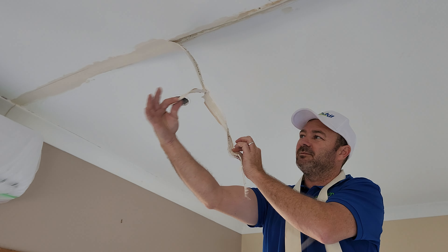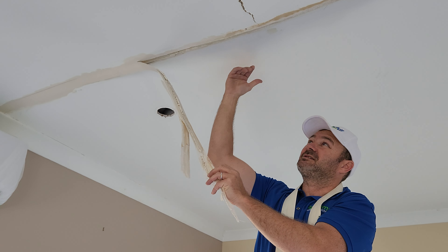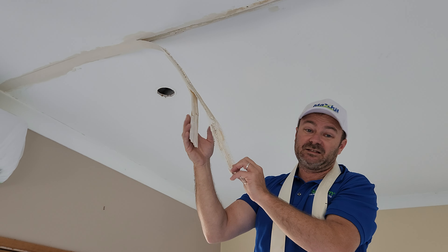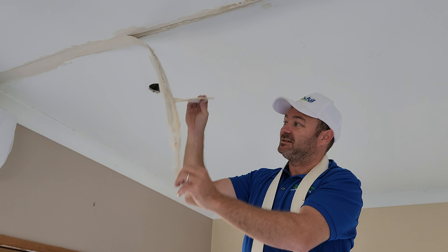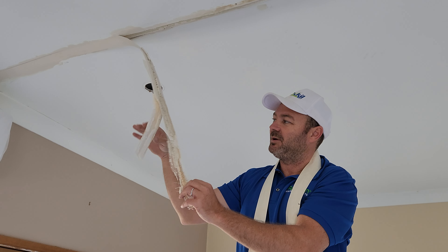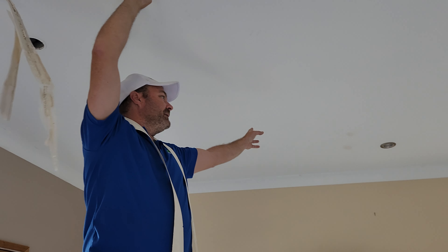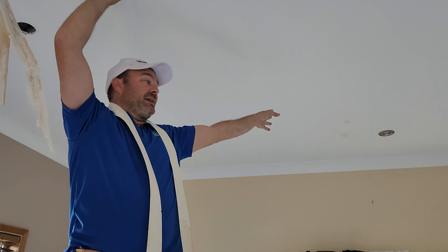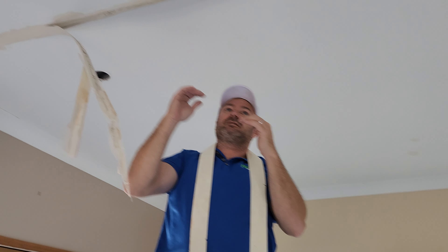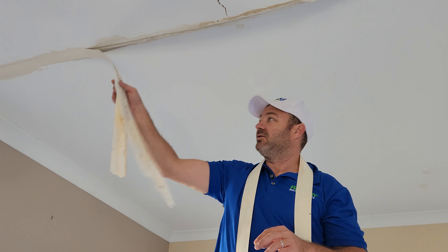So they've got paper and mesh. And before this got water — sure enough the roof leaked or something — but before it got water, this failed. Some genius came in and thought mesh tape's no good, we're going to paper tape straight over the top. And this is what's happening. You probably can't see it from there, but this area hasn't gotten any water and it's got a small hairline crack as well. It just shows that it doesn't hold back anything at all.